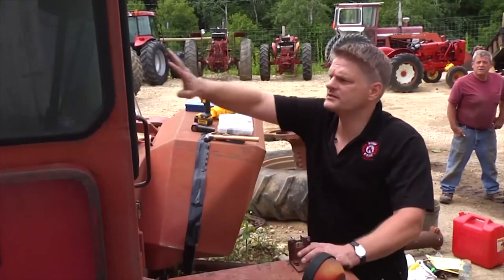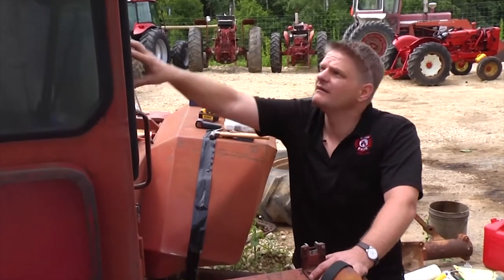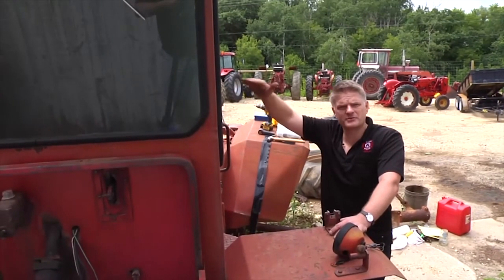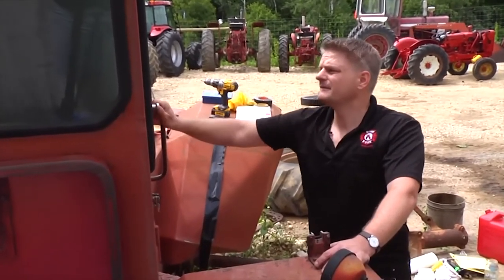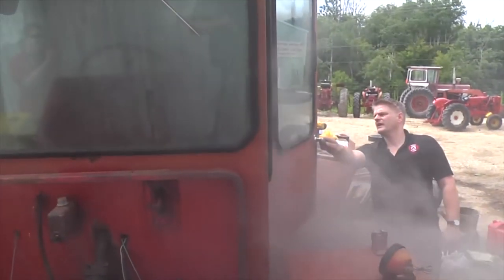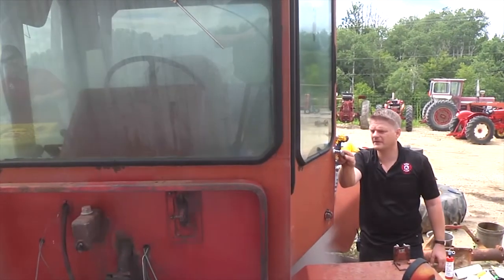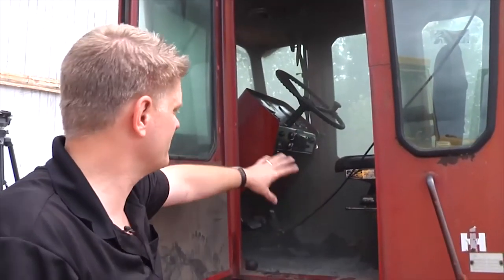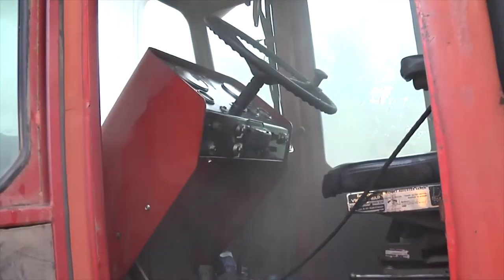What we just did was test the automatic inside the cab of this machine. It got real black real quick inside, and once it hit the right temperature, it went off. The key is making sure that you mount it properly. Now you've got all the smoke coming out of there. You want to let it cool down before you give it fresh oxygen so it doesn't light back up again. And the beauty of it — no mess in here, none whatsoever.